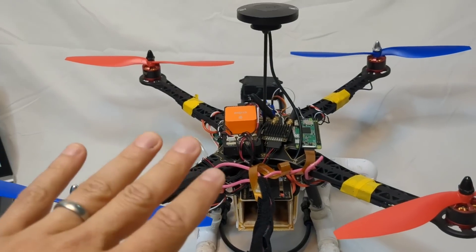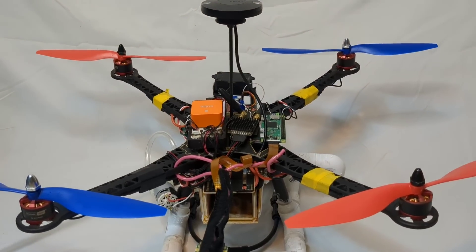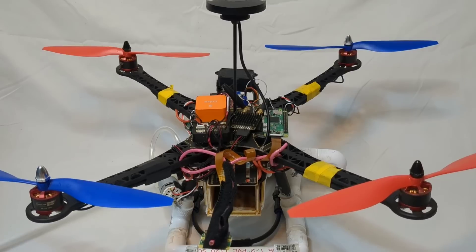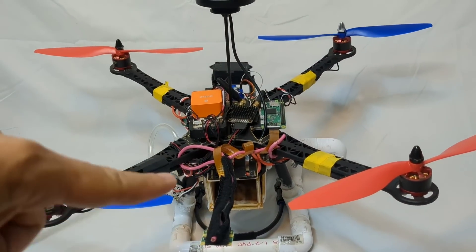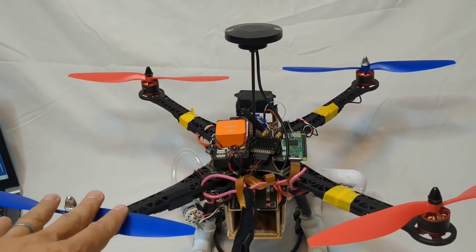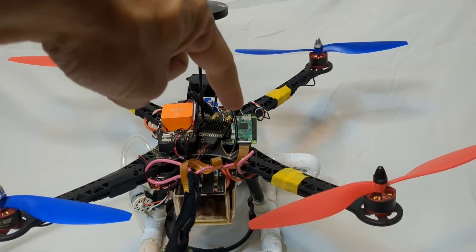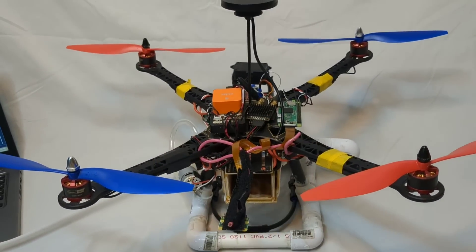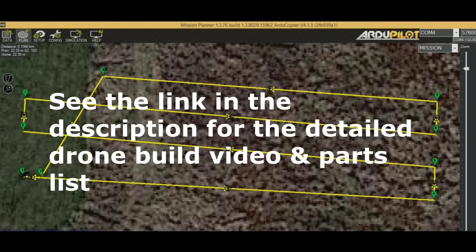In summary, this is a fairly standard drone; even the autopilot electronics aren't uncommon — lots of folks use ArduPilot and Mission Planner for auto missions. What's really unique is the Raspberry Pi camera, tank, and sprayer. Think of them as two separate systems: the drone is just a transport that flies around one or two meters off the ground, while the Raspberry Pi constantly snaps images and turns on the sprayer whenever it sees a weed — no connection between the two systems other than battery power. A detailed step-by-step video on the drone build is the first link in the description.